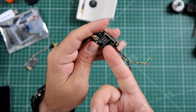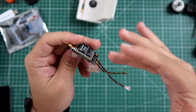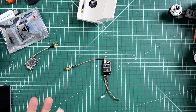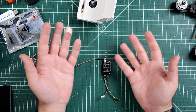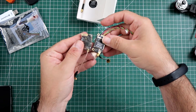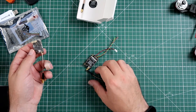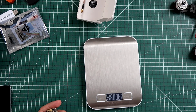The transmitter section itself is pretty standard — seen in many many transmitters. It's a separate board on top of the CPU board. I connected this to a quad, connected one wire to a serial port for smart audio in Betaflight, and it worked. It's visibly bigger than the TBS Unify Pro, but not by that much. The MMCX is a nice choice and no stupid connectors.